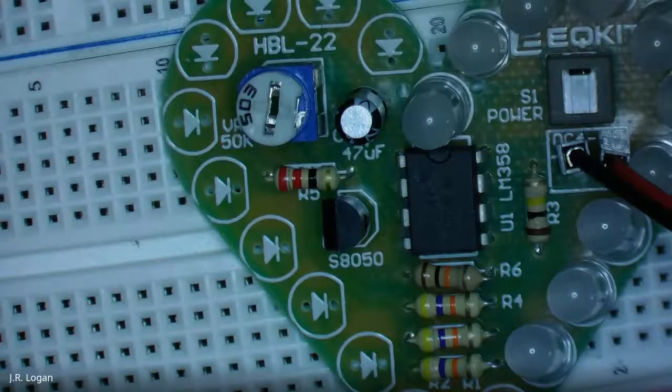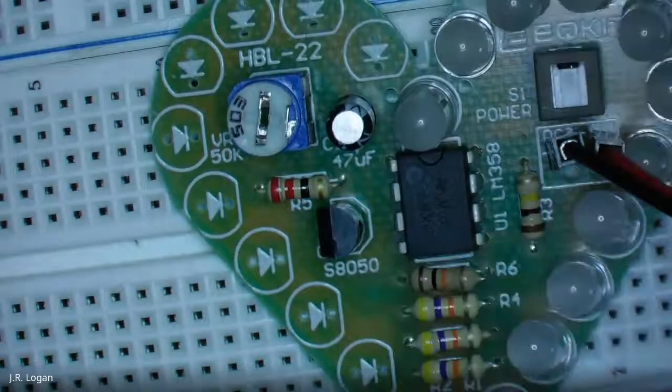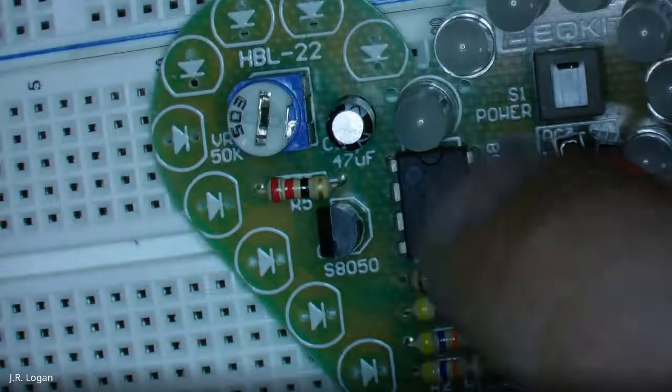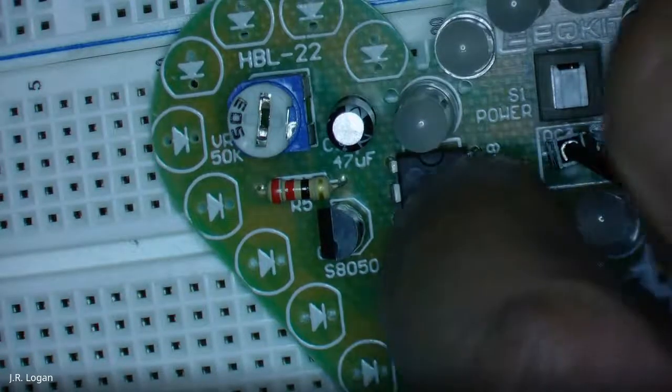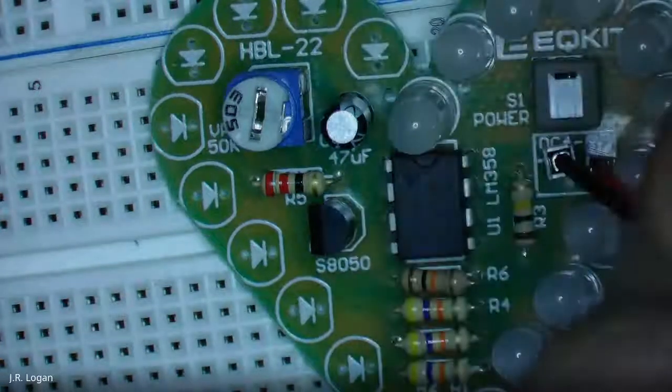At MakeHaven, there's a little oven that looks like it has a little drawer on it, and it's on the electronics workbench. And that is for surface mount soldering. You get special components, and you print this board so it has little copper pads. And through the magic of flux and solder, the solder is actually attracted to those little pads. It wants it to happen. So as long as you place it pretty well on top and it sits loose, and there's a mixture of flux and solder, it's all mixed in together.